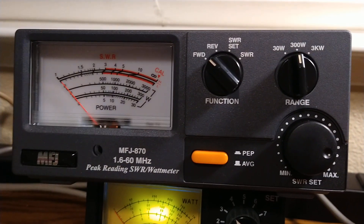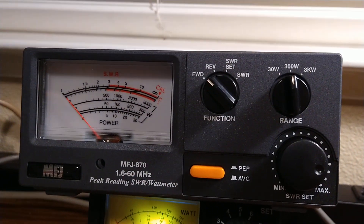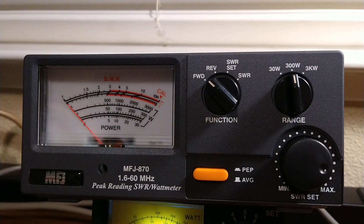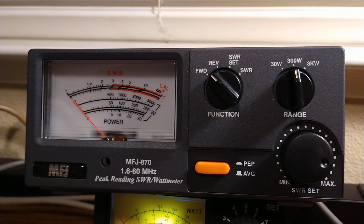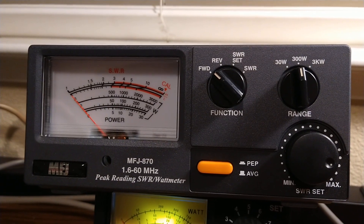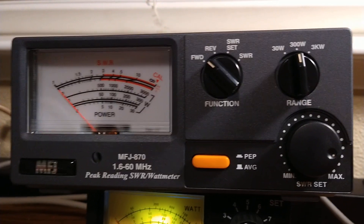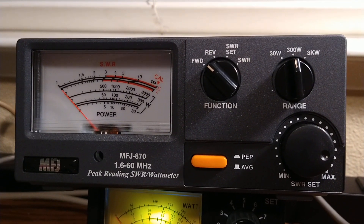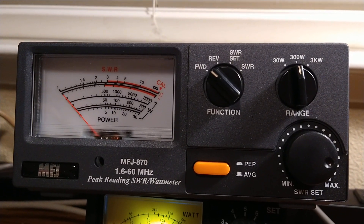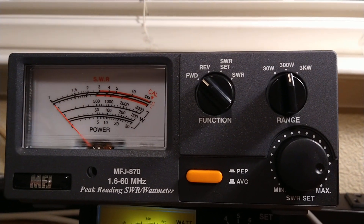For the money — depending on where you get it, about $100 to $130 — when I got the last two of these they were right about 100 bucks each. They're not bad meters at all. Everything on them is really accurate except for the PEP power. You can open it up and there are eight adjustments. It's not all the ones lined up in a row you want — it's the three that are off to themselves. Those are just your 30, 300, and 3,000-watt scales. And to my surprise, when you adjust one, it doesn't affect the other scales, which I've found in the past some of them do.